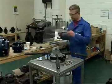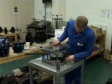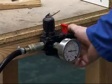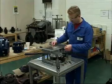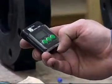A guard is added as a safety measure. Low pressure air is fed through the test rig into the lower half of the closed valve, while the reservoir above is inspected for any air bubbles rising from the seals and seats. Valves have to be bubble tight for the specified test time period.